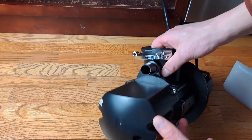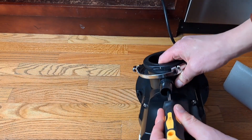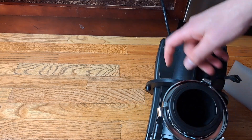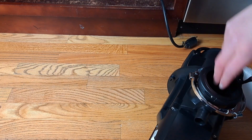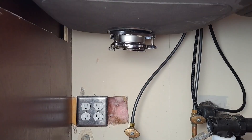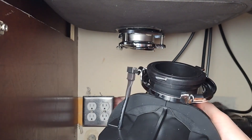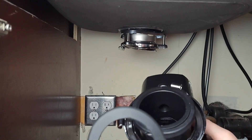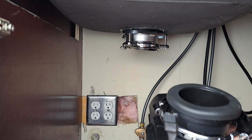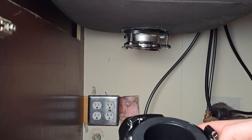If you have a dishwasher, you need to knock out the little plug in the disposal. Push it through — just a little rubber piece. Now we're going to take the Supura motor part and take the little gasket that comes separately, and slot this over the top. That's important to make sure it doesn't leak — it doesn't come pre-installed, so you will have to get it out of the bag, but it does come with the Supura.